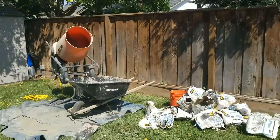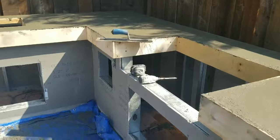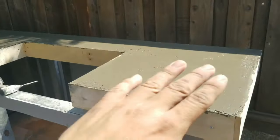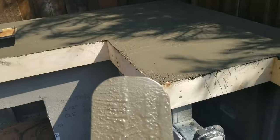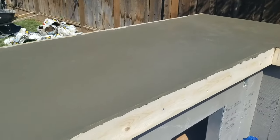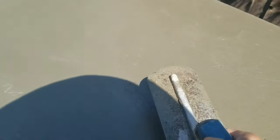The mixer was very very helpful. The wheel came off about twice when I was trying to get it up. Most of it I did first with two two-by-threes — screeded it all level — then got my wood float and kind of flattened it out. Waiting for it to dry a little, this area is a little dry already. Then I went at it with the metal trowel. I had a square one but decided to round it off — makes it a little easier, less marks. As you can see, it looks pretty nice. You basically go in a circle pattern, kind of like this.